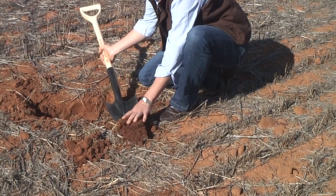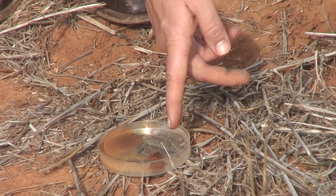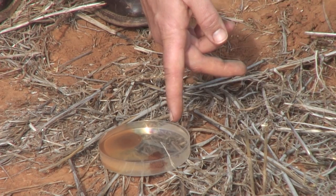The main things to take away from today's video: take some soil from the surface, place it into deionized water, and make sure you clear a fresh face on the soil so it hasn't touched the air. Place it in the water and leave it — don't touch it for 10 minutes and watch how it reacts. A soil that falls apart and creates a cloudy solution is indicative of a very unstable soil.